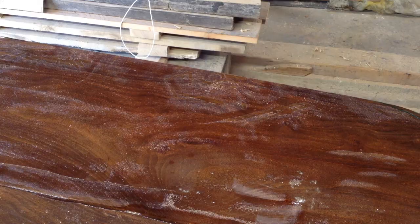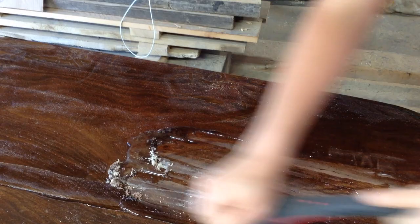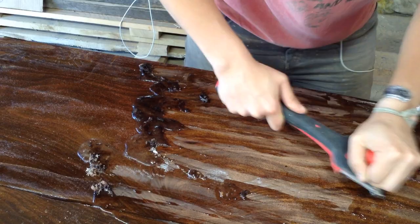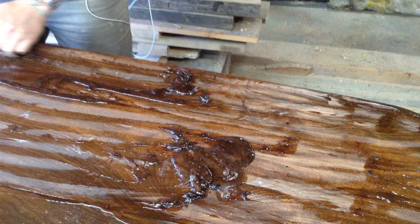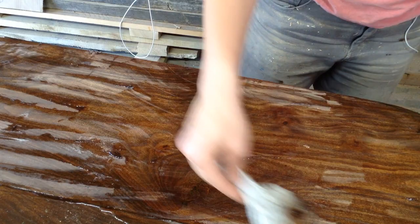There's a varnish on this table and that's what comes up first. I went through with two coats and took it all off. In my other refinishing video people mention PPE, and I like to think I'm fairly good at wearing PPE, but the word 'personal' is in it - so wear what you feel comfortable wearing. I'm not wearing gloves for this because I'm using tools with handles and I'm not getting any of the stripper on my skin - because if you do, it burns like heck.